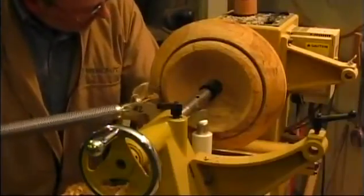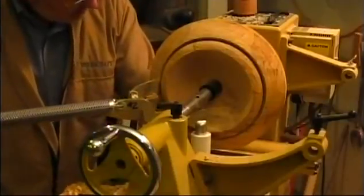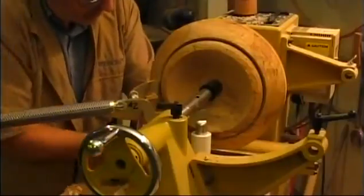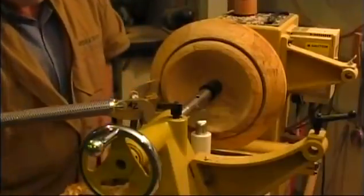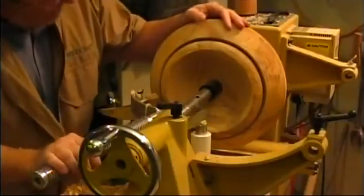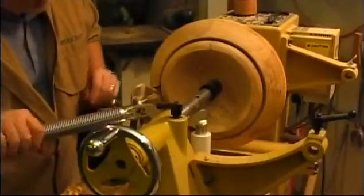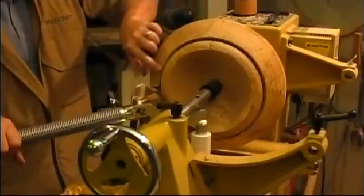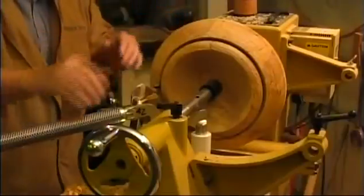And I just want to make sure that I've still got some freedom here. Okay. You won't be cutting too shallow now to where it comes back out. I shouldn't be. I think I've got plenty of meat here for this piece already. And actually the way I did that, I'm coming out, I'm going to end up widening the kerf a little bit up here, but as it comes in, it should end up kind of closing back off.